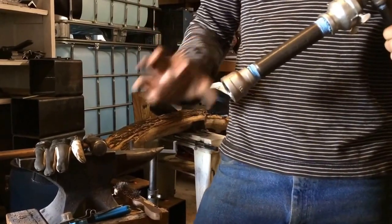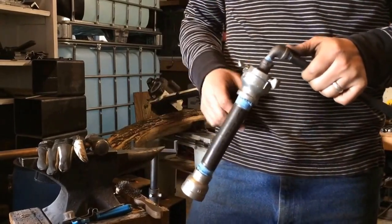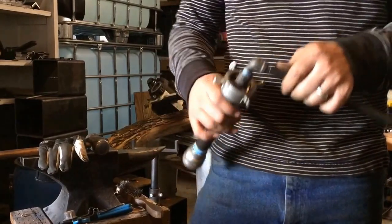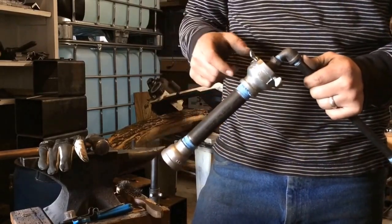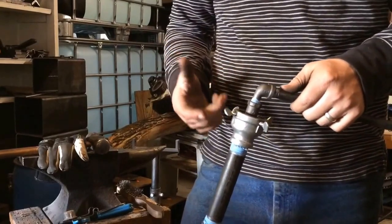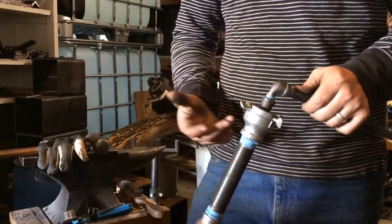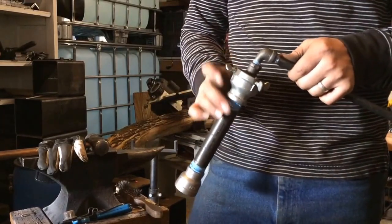I think that is the perfect flame in a propane forge. You can adjust it a little bit — you can put a choke on here. This is a one-and-a-quarter by three-quarter reducing coupling. I use one and a quarter: one and a half is too big and lets in too much air; one inch is not big enough and doesn't let in enough air. This size seems to get it right on the money.